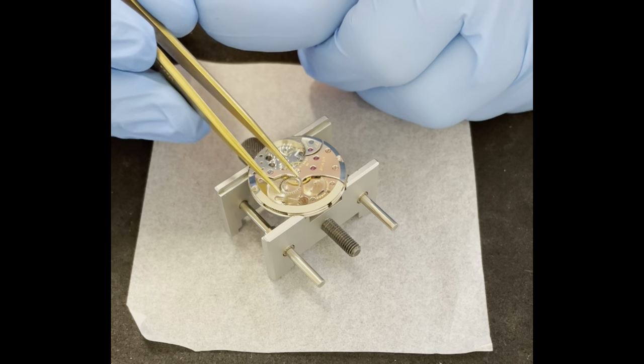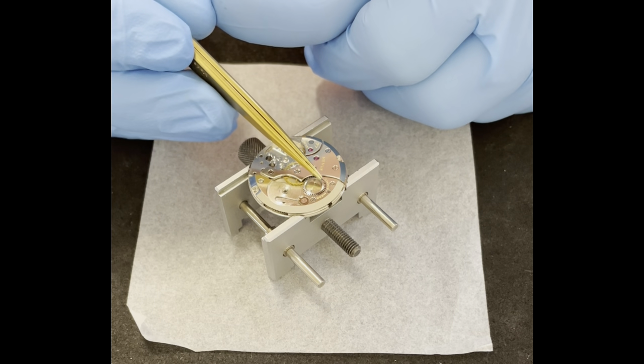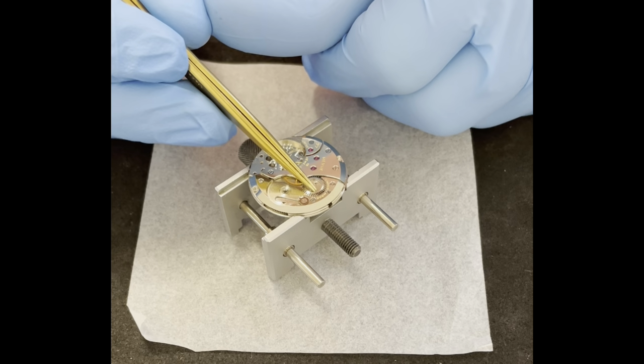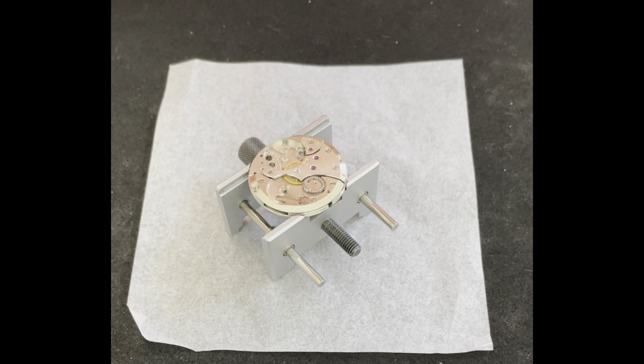What Rolex does have, this doesn't have: the Rolex has a little steel plate underneath there, so I guess they add up in terms of quality like that. I would have liked a little disc on the underside here to protect it, but it doesn't. But the finish on the crown wheel here is spectacular. And same goes for the ratchet wheel we're going to fit in just a second.